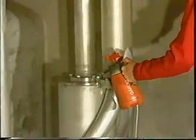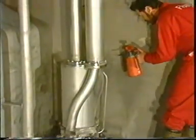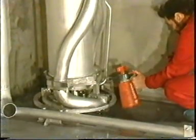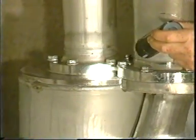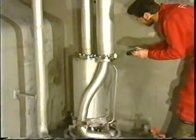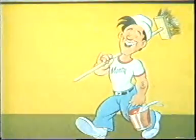9. Never start dismantling of any cargo pump or other component in the system before you know if, what and where you have a problem. 10. Pressure test the cofferdam in order to detect leakages. Cleanliness is absolutely necessary.